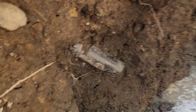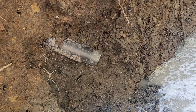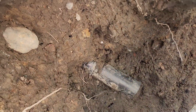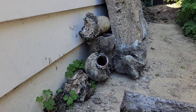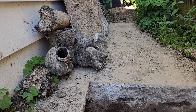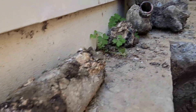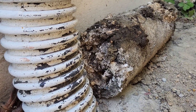What we have here is the two-inch ABS pipe, you see there, comes out from the basement wall. Somewhere up there is a 45-degree turn, and it goes down into an old concrete tee, which is that abomination laying flat, sticking out from the side of the house, and this is what was in the pipe. No wonder the drain was clogged up.